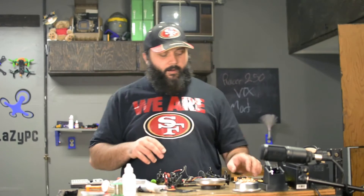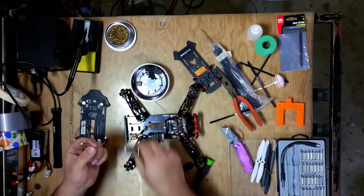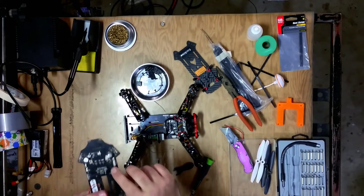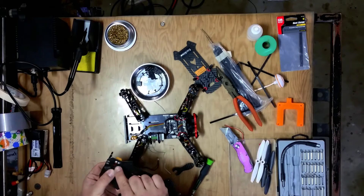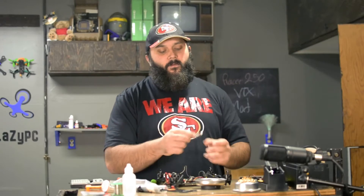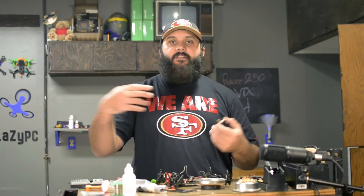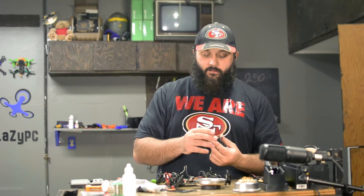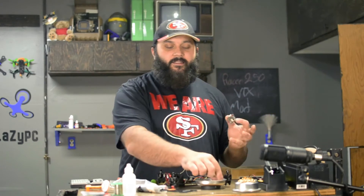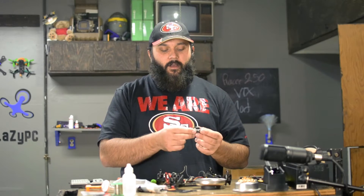For your power wire, you have two options: extend it so it reaches the back, or do what I did in one case — I soldered it directly to the bottom two connectors where the LiPo connects. The power for this VTX actually has to be connected directly to the LiPo; that's the only way the built-in OSD will send you the correct voltage in the FPV view. Something else I always like to do is put a heat sink on VTXs — it just extends their life and increases durability. There will be a link in the description to heat sinks like this one.